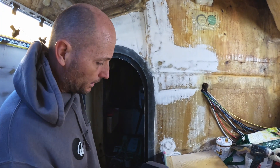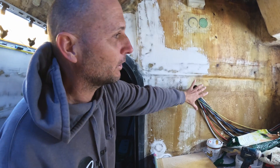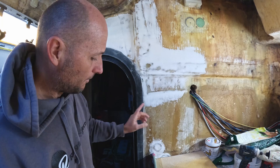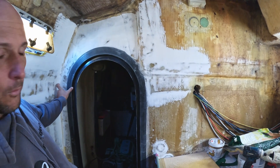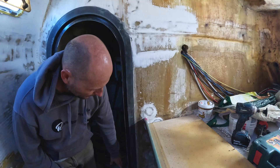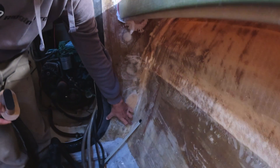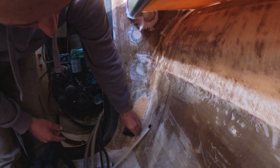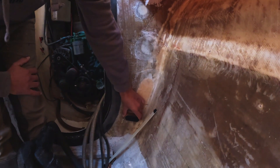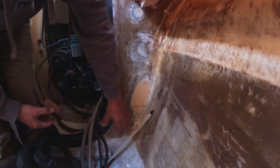The biggest concern is: if I push a hole in through here, you can see it's in the middle of a big structural area, so the problems of a penetration here are much lower than if you put holes this far away from edges. And in particular — this is why the Lagoons had their failings — if you look down here where a door edge comes close to a hull structure edge, there's not much material, and if you go and slam a great big hole in here, there is no more boat structure left. This is why people suffered failures in their bulkheads.